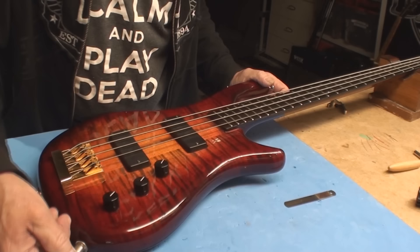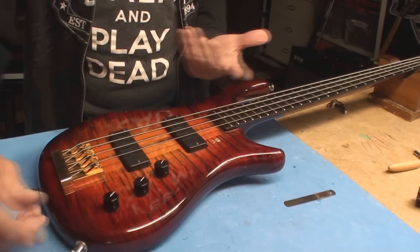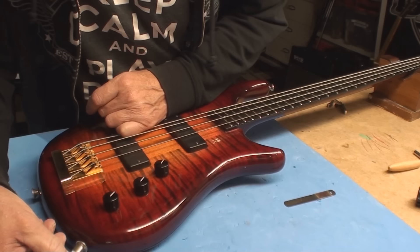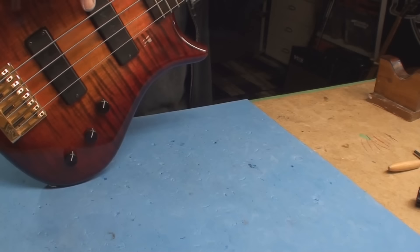Output jack needs to be replaced. I don't know if I have one of those but I will look. On a normal Switchcraft you can go in there and push the little tabs in so they make better contact. But over time the insides are just not doing what they need to do and there's nothing you can do about it. Make a living replacing all these stupid things.